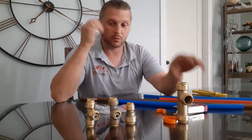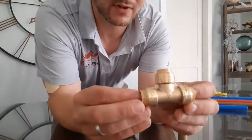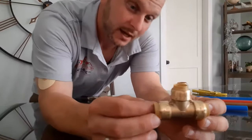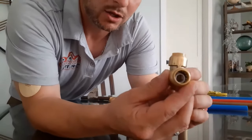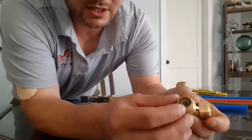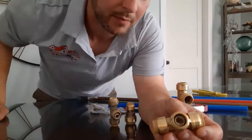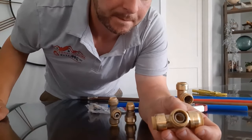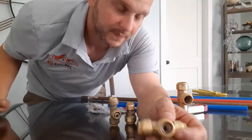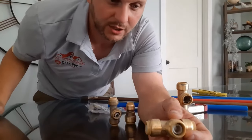What you have here is a brass fitting — this is a brass SharkBite tee. I want to show you this a little bit. You've got one end, one end, and one end, and that makes the tee. Inside here you see a little nylon that is to slip inside the PEX pipe. Now, if you're using copper, some of these say you're supposed to pull the nylon out. Some do not — I would read them and do what the manufacturer says.